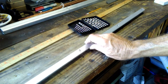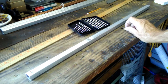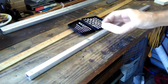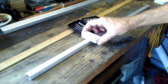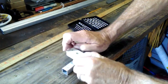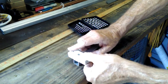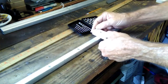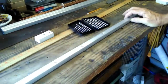You attach — you build your insulators and attach them. Getting your measurements right is very important because when you build your insulator right and the hole is correct, you center that on there and your measurements are going to stay right. The reason I come down a half inch is these are an inch wide — it gives you a half inch to set your insulator on, so you've got good backing and it's not hanging off the edge. Make your insulators, attach them, then go on with bending and attaching. There are more videos here to show you how to do that. Good luck, guys.